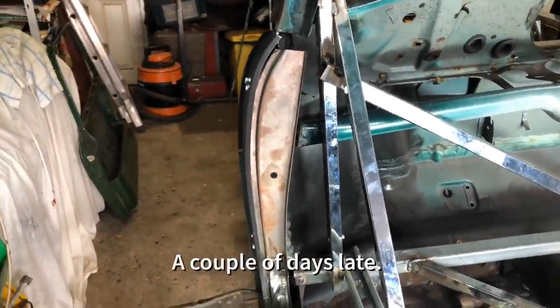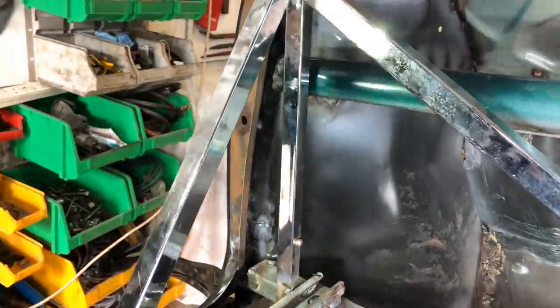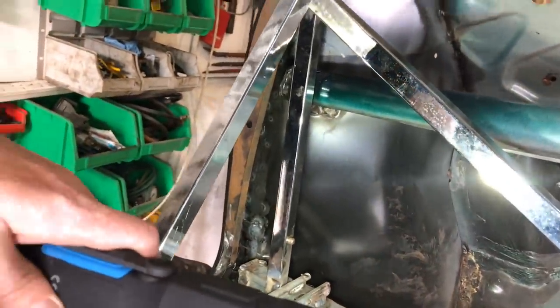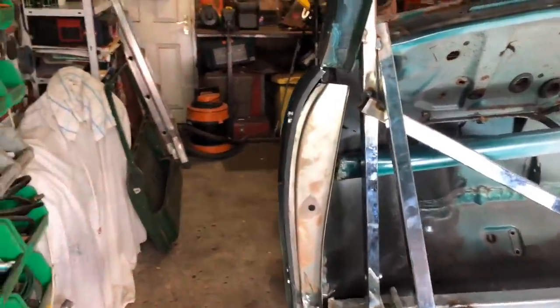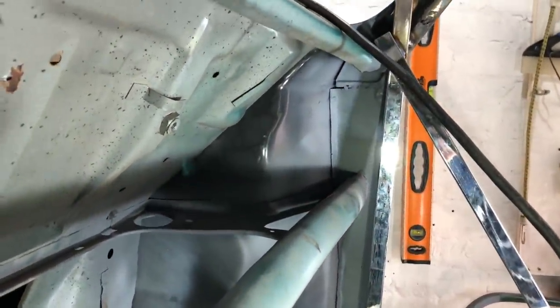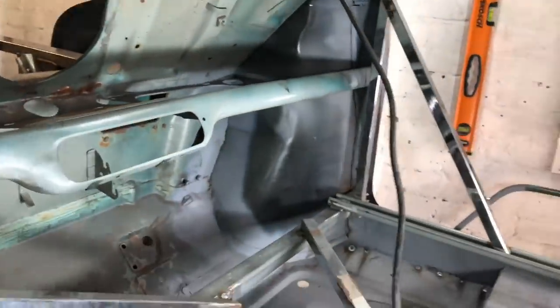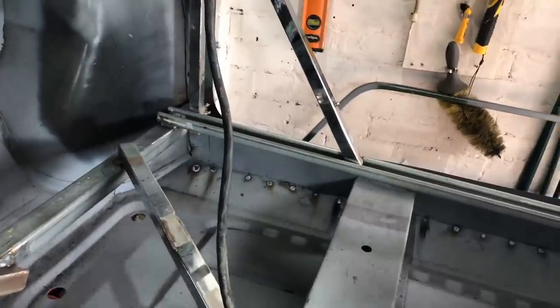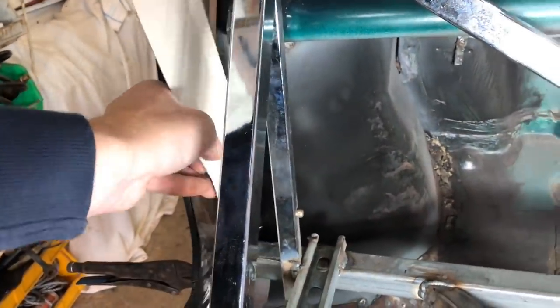Right then, so the next bit is to close this A-pillar in with the closing panel in the back there. It's hard to see because of the boarded bracing, but that's the front of the A-pillar, and then we need to close it in up to the bulkhead with that area just in there. So it's the same as the opposite side. So we'll see that closing panel that runs down the side of that dash rail. And we've got a template which we used on that side, which we can just reverse, and that'll slot down into this side.